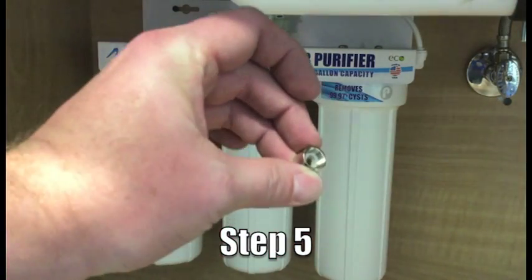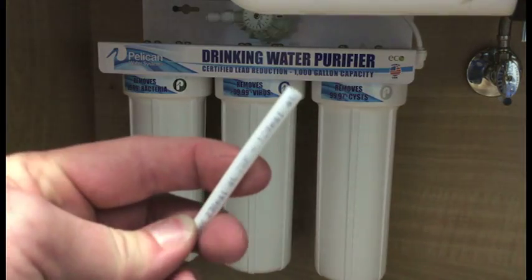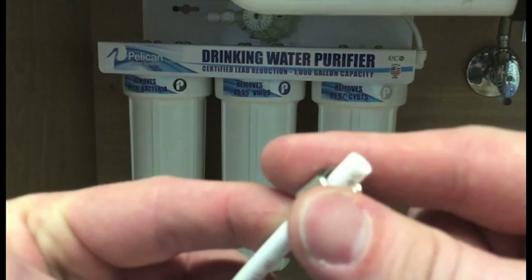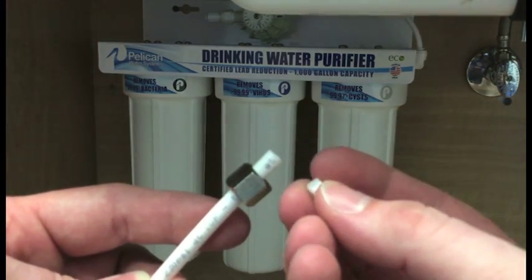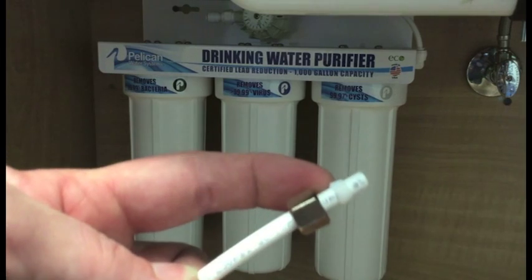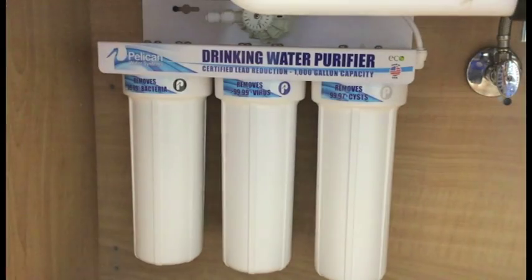Step five, we're ready to install the tubing to the faucet. We'll first need the compression fittings we removed earlier. We'll take one end of the quarter inch tubing, slide the compression nut over first with the threads towards the end of the tubing, and then slide over the compression ferrule. On this ferrule, one end is tapered and elongated — put that end towards the faucet. Fully insert the tubing to the threaded downrod, slide your compression nut up, which will push the compression ferrule into place, and thread on. Hand tighten first, then follow with a few turns with a crescent wrench.